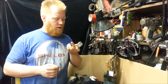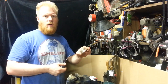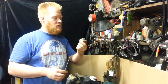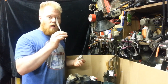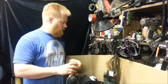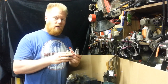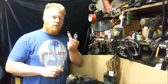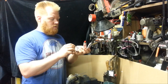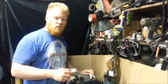It's not very friendly as far as working. I have a video up of me doing a riding mower transmission — I actually fixed the whole trans, the aluminum transmission is still in service with this aluminum weld stuff, this aluminum brazing rod. Really cool stuff. Now I can put this back into service a lot quicker than JB Weld. It'll hold up a lot longer than JB Weld, but if you're in a pinch to fix the carburetor bowl, JB Weld will hold up. It works in those Tecumseys where you got the little bowl drain that falls out — just finish pulling it out, seal it up. Thanks for watching guys.